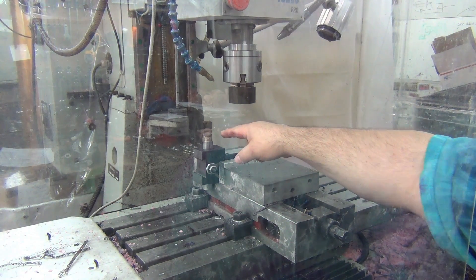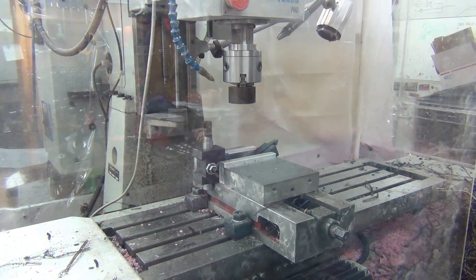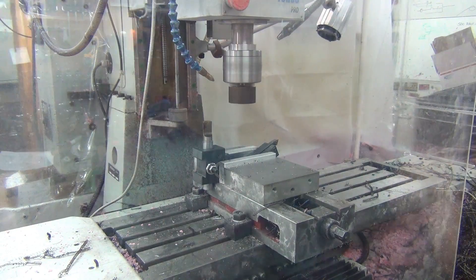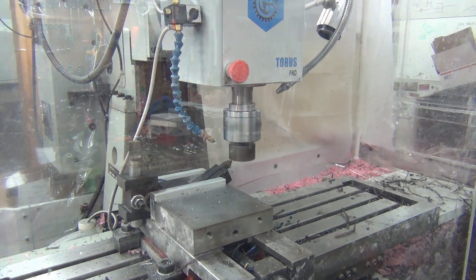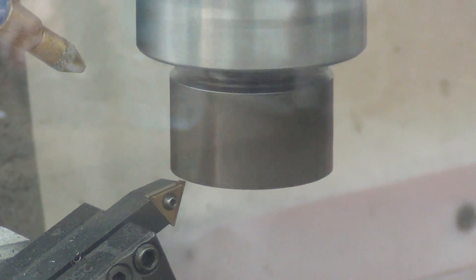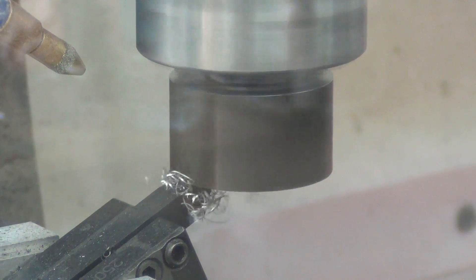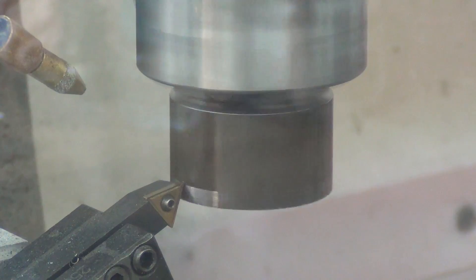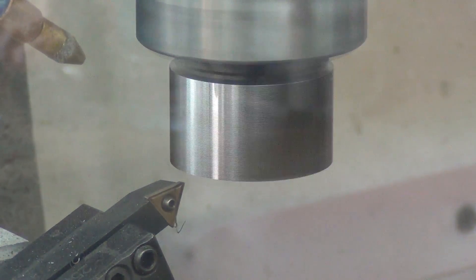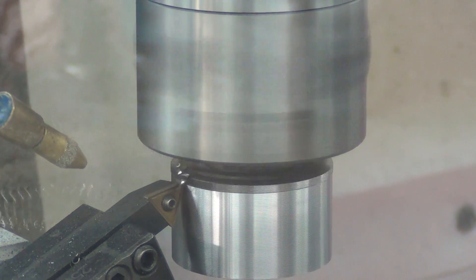I have this one set up as G56 and this one as G57. I'm using the same code I used last time I did these, but I've changed and tweaked it a bit. Cycle time is just under five and a half minutes. This is 800 RPM at 11 thou per rev - the whole program runs inch per rev. The tach on the power drive bar says it's 750, so it's somewhere in that neck of the woods.